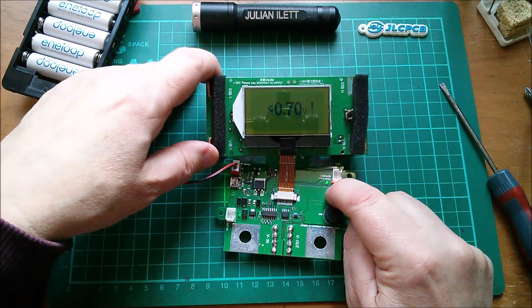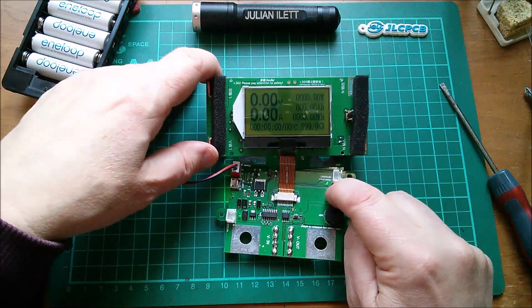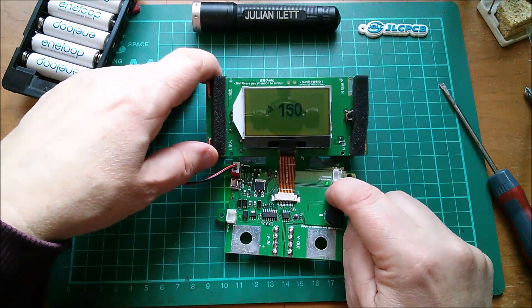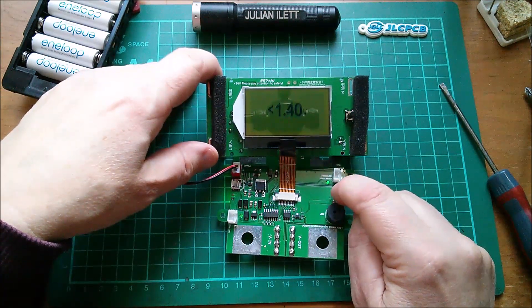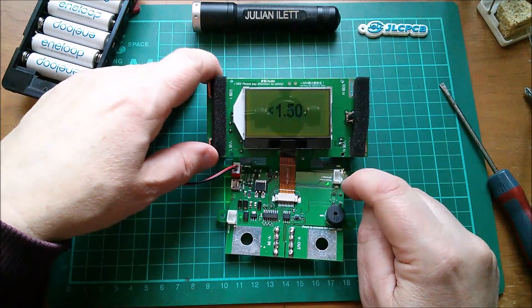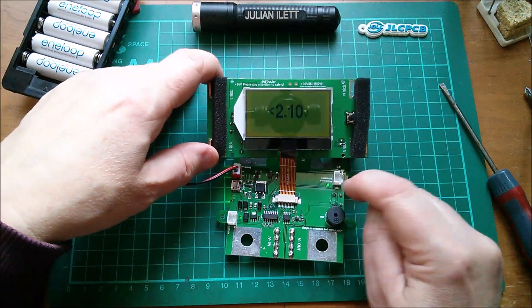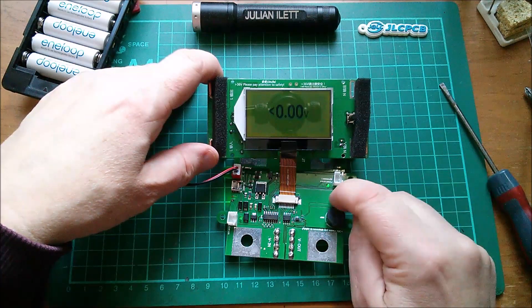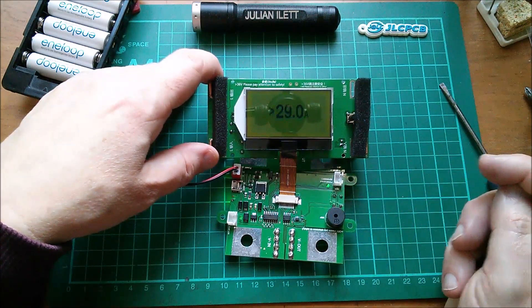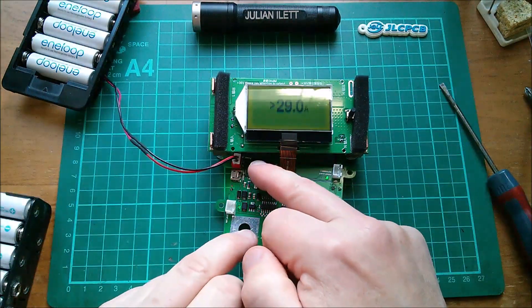There's an alarm alert screen. Going back, that's the backlight-on screen, that's the greater-than-160-volt alert, and that's the less-than screen. If I press and hold that goes up; double-click and hold still goes up; triple-click to go down and hold — that's now going all the way down to less than zero volts. Change screen to save it, and that should eliminate the beeping because it was detecting less than a set voltage on the input.